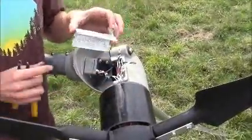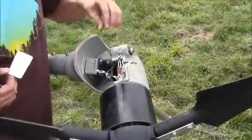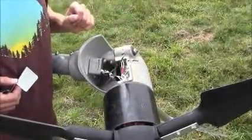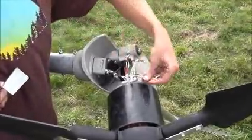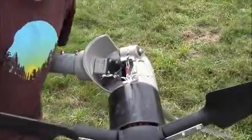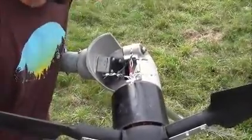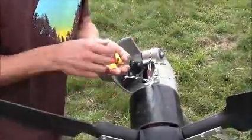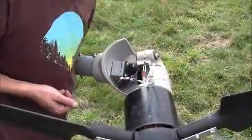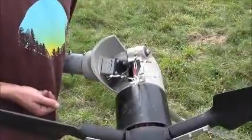Using the chart on the back of our multi-voltage plate, I reconfigured the wiring with our interchangeable brush wires to our stator wires. I reconfigured it without actually putting the wire nuts in first, just to organize myself, so I can go through now and attach my wire nuts. Remember, the red wire nuts attach to the brush wires — these three wires here are going to get the red wire nuts, and the other two are going to get the yellow wire nuts. That's just to help keep yourself organized.